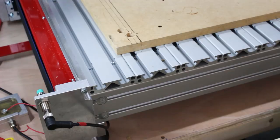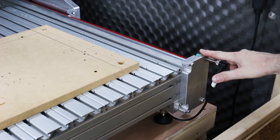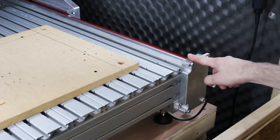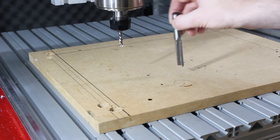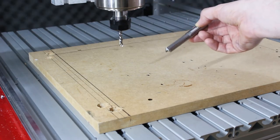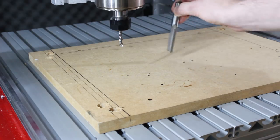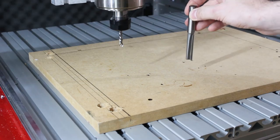As I mentioned in part one, we've got a home switch here and there's also one in this corner. Adjusting this one in and out will adjust the square of the machine between the ball screws on each side. So the next thing to do is check the machine and the spindle's actually square this way. We can do that by using this big half-inch end mill — by cutting a pattern and seeing if there are ridges between the lines we've cut, or whether we've made a smooth surface.